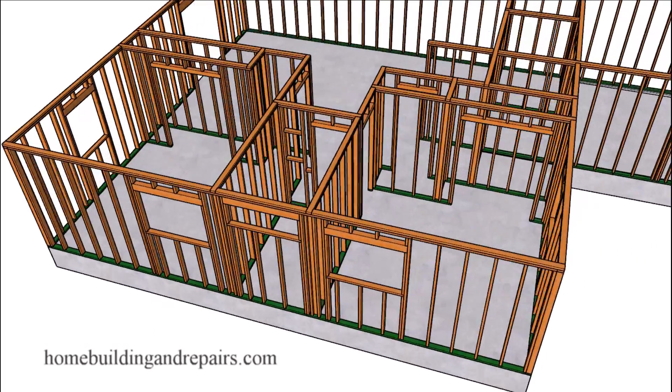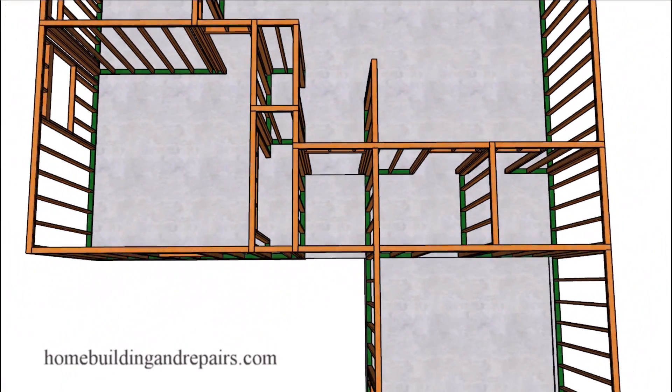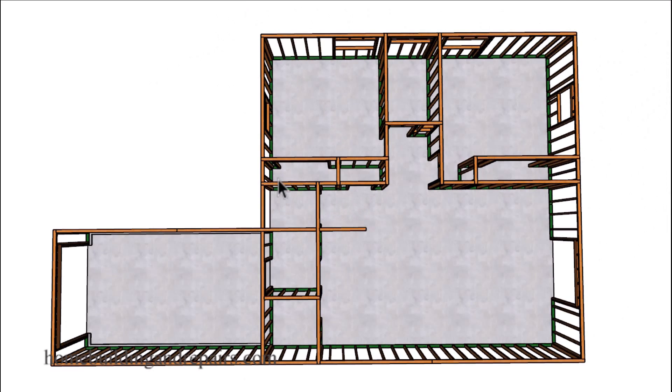Here's our bathroom window, then the front bedroom with its front window and the door coming into the bedroom. Our porch beam here is going to be supported by two 2x4s on each side and will sit into a channel. We do have a long wall providing a nice structural tie. We can run a strap across the top and block the ceiling joist so that we get a nice continuous tie through here.